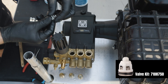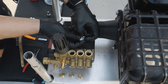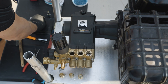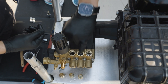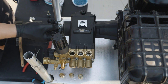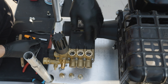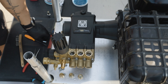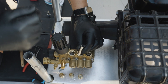For each valve on the top side of the three, remember the cage is going to be orientated down. We're going to make sure that we put a little bit of grease on each of the o-rings before installation. Before we put our caps on, we'll want to make sure that we seat these into place, because just dropping them in and putting the caps over top runs the risk of damaging the cages. So we'll take a socket that fits just inside and apply even pressure until you feel them seat into place.